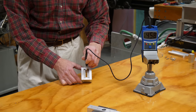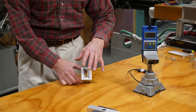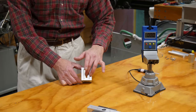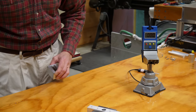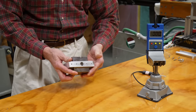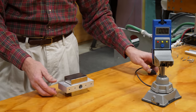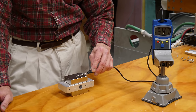That's very convenient for a lot of research we're doing. The two magnets act to isolate the effects of that dispersing magnetic field coming from the opposite poles and pulling the field lines away from the gap. If you want to create an even stronger magnet, you can use more powerful magnetic materials. Over here I have a larger gap magnet fabricated for a recent video on refrigeration. In this case I'm using N52 magnets, and you can see that on the surface of this stronger magnet we have a field of about half a tesla.